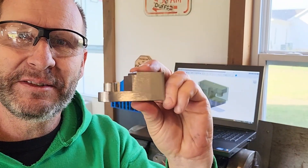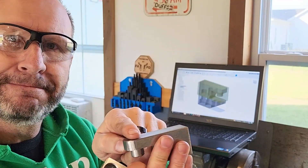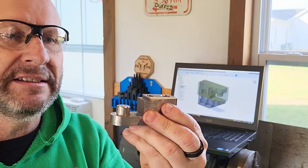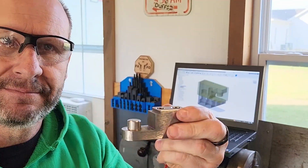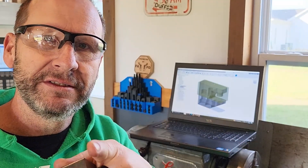I'm going to stick the camera in front of the mill — you'll get a nice glare — and hopefully make out this part. I've already done up one where I've faced this, contoured it, I've flipped it in the vise. G54 is on the bottom of this part, in center, in my work coordinates, and now I'm going to mill in all these features. Hope you enjoy it. Cheers.